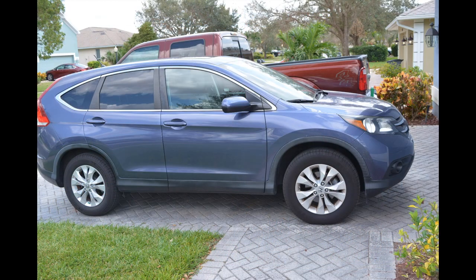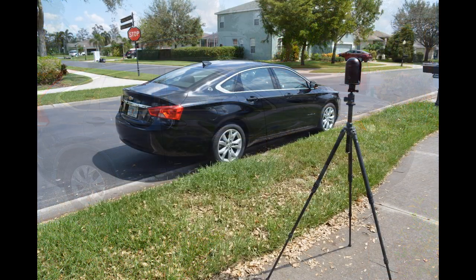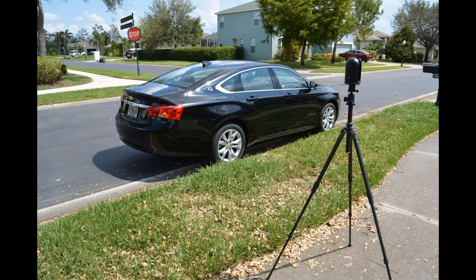Last is scanning cars. When scanning cars, you need to keep in mind how to tackle both the color and a mirror-like surface. This is where it's most evident that not every scanner is made alike, because most higher-end professional-grade scanners will have an easier time with surfaces like these since the laser system is built very differently. Cars that have just been through a car wash and are wet can be challenging because the body of the car is shiny — if you remember the cooktop example, the laser will just reflect off the surface, resulting in a void in the scan data. Furthermore, in many cases, shiny black cars can be the Achilles heel for many scanners on the market today.